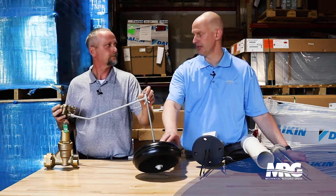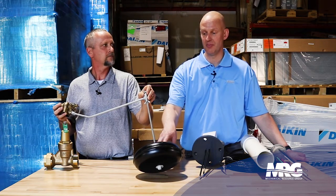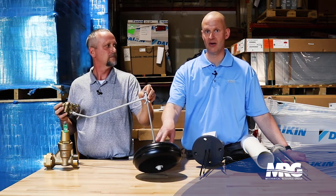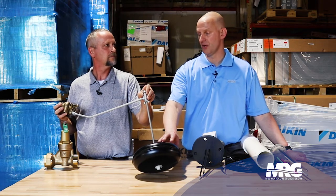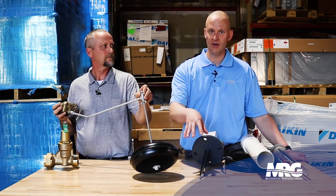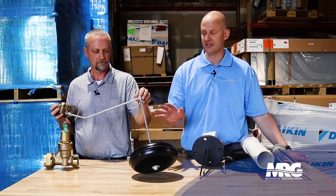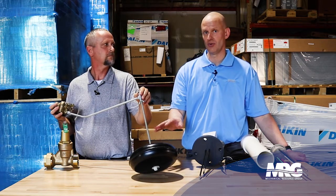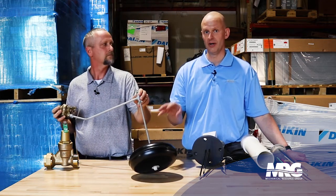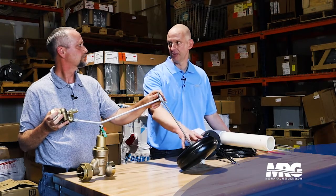This is plastic, which was mentioned, but it's also insulated — they use a foam insulator and inject foam inside, covering the holes with black silicone. Year after year you can get a little hole in there and these things can soak full of water. When it soaks full of water, it becomes heavy and it'll do the exact opposite — it'll be weighted down and you won't be filling up your basin like you should. This is the cheapest way to maintain water level control in a cooling tower. We've had clients who lost $40,000 worth of water that was going over their cooling tower and down the roof drain because they had a cheap float.